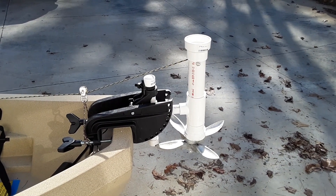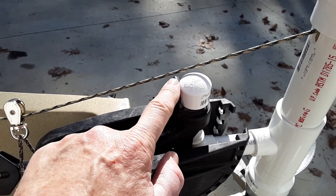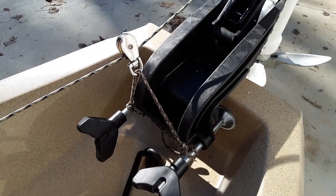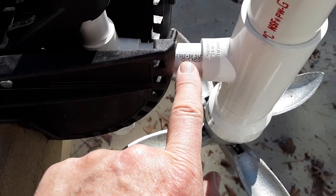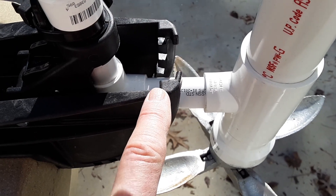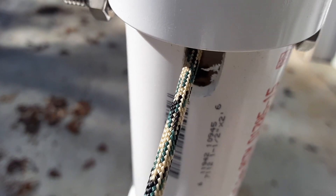Here's an inside view of the storage tube with the bolt that runs through and the two nylon spacers I'm using as a friction-free pulley. I wanted to give you a closer view of the clearances. Right here you can see clearance over the front cap so there won't be any binding or rubbing. By using the three-quarter inch extension, it pushes the flange out far enough so it's not going to bind or rub on the back end of the Minn Kota mount. The slot you put in here allows the cord to pull freely and not bind when you're retracting the anchor.